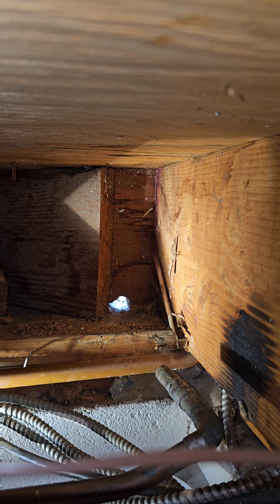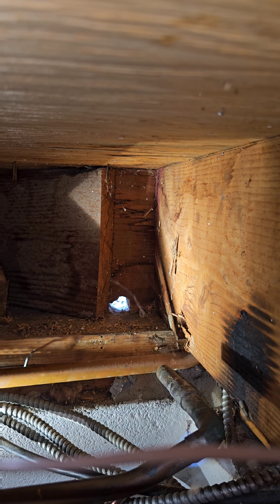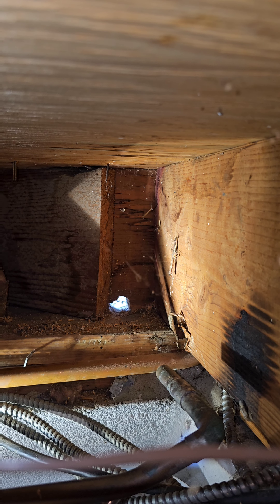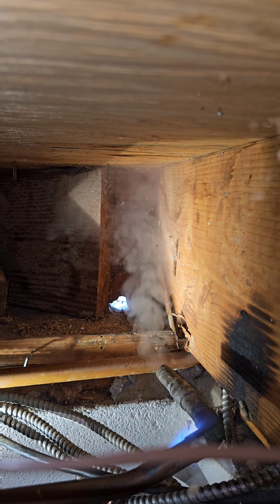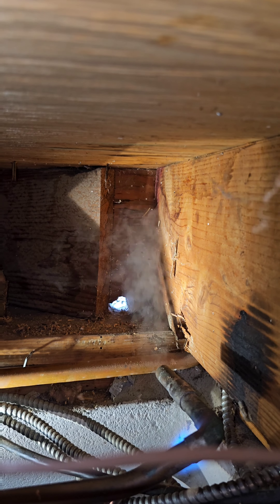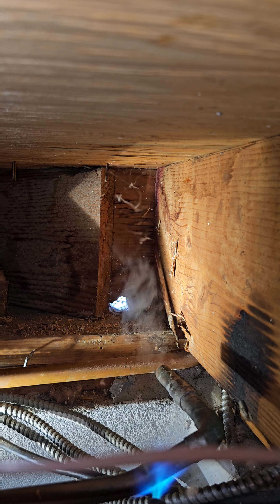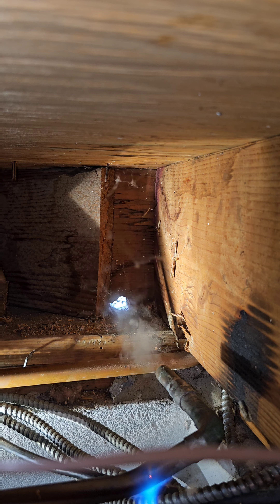I'm inside clearing out everything and letting him know it's clear and good to go. We start assembling - I'm going to start sweating the old 90 going to the spigot. I pull out the torch. Guys, if you're going to use the torch and solder next to a joist, you can see the joist here is burnt. The old plumber wasn't good with the torch - burned the joist. That's a pet peeve of mine. Just put something there - I like using a heat shield, a piece of metal, anything to block the wood from burning.